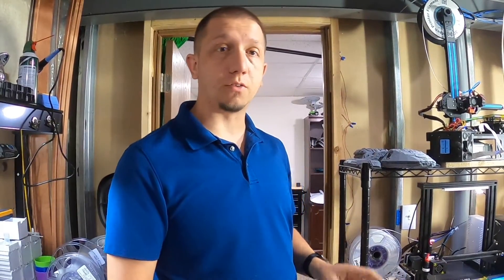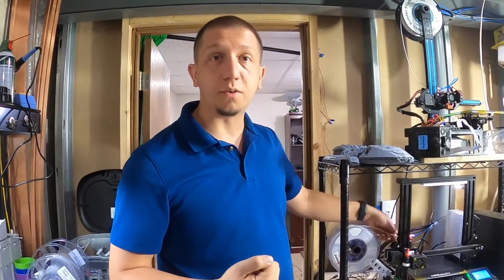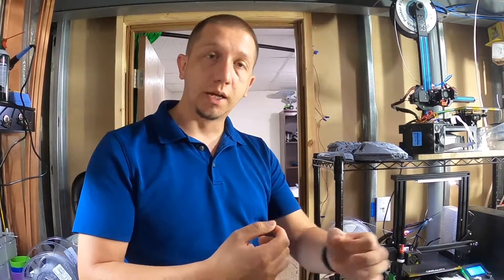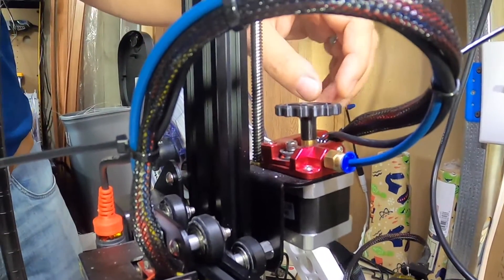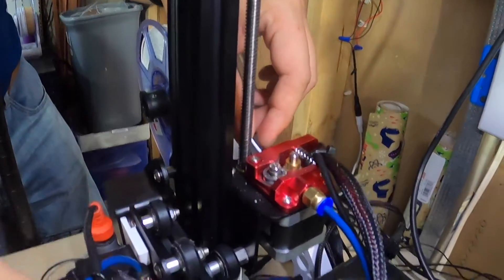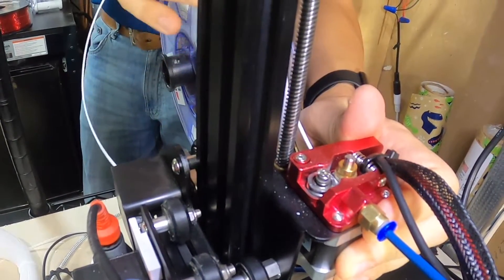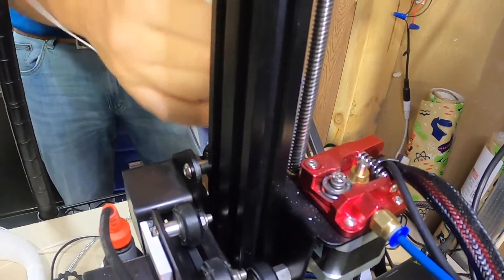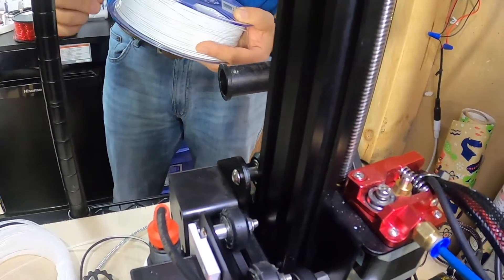The printer is heated up to 215°C, so now it's time to get the old filament out. I've got pretty much a full roll, so I won't have a hard time pulling because I have filament to grab onto. But if you've run out of filament, it will often be up in the Bowden tube where you can't reach it — you'll have to undo the Bowden tube at the extruder and use pliers to pull it out once heated properly. I'm going to take this knob off, press to release the pressure on the filament, then gently start pulling — and it should just pull out like butter. Try to keep your roll tidy without letting it get tangles. If storing it for a long time, keep it in a dry, clean place.